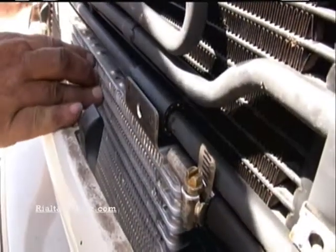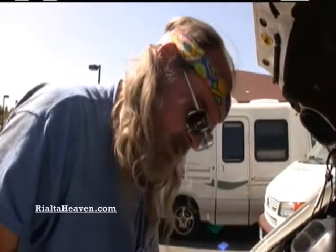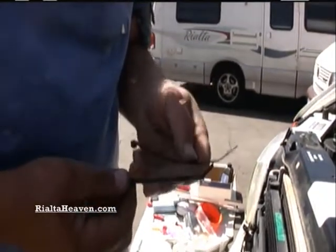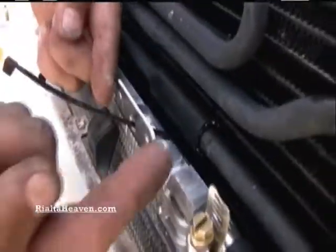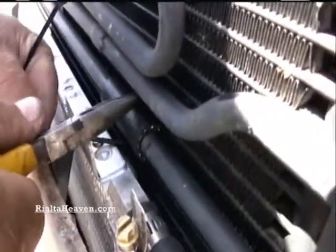Pretty close — we're going to have to move our hose just a tad to get it all lined up, but it all fits. Now a couple of little tie wraps — I know that on 3M, the black ones have UV protection built in and the white ones don't, so I tend to use the black ones. When you try to get this through the hole underneath your little piece of hose and then back out on top, it's easier if you use your needle-nose to grab the end of that tie wrap and pull it back out.